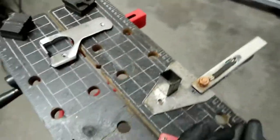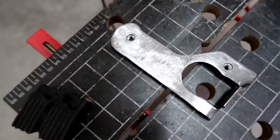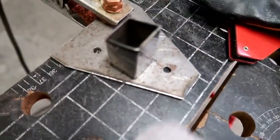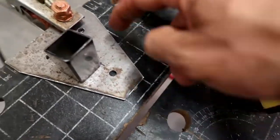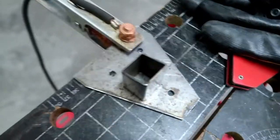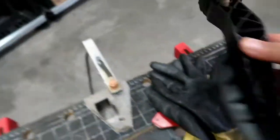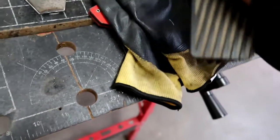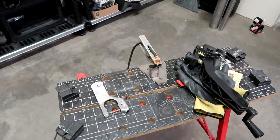Got this little mount set up for the pedal here. I cleaned it up and got all the paint off because we're going to repaint it and weld everything. The pedal assembly will go like that on the plate, then this gets welded to here. We decided to go with square tubing as opposed to a flat piece because it'll be a little stronger. We also cut a bit off the bottom of this pedal to make it fit better in the truck and did a little rounding on the sides to clean it up. I'll set you up on a time-lapse and we'll get going.